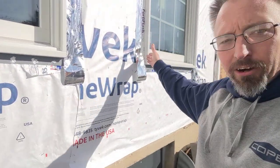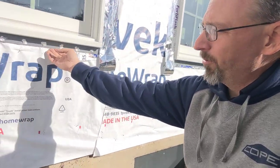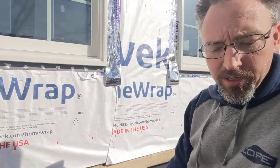So we're preventing air entry and we're preventing water entry on three sides. Then we're leaving the bottom where it's loose so water can get out down there if need be, for any water that gets into that drain cavity that we're creating around the outside.